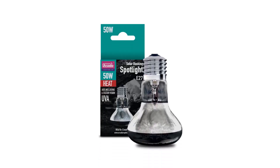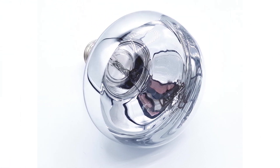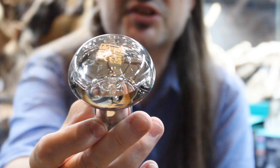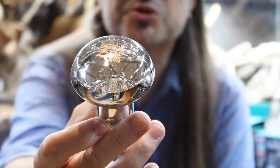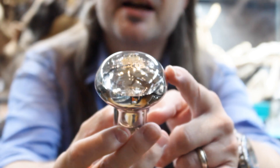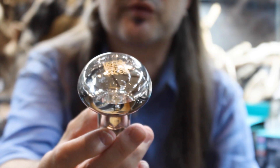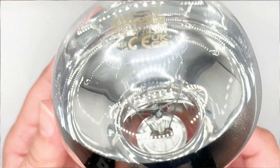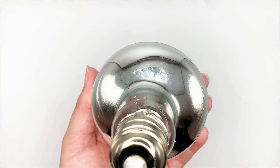This here is a 50-watt tungsten spot lamp. If you can see on the inside, there is a tungsten filament coil all wound around a cradle. As you pass energy — positive and negative — through the lamp, it basically shorts out through the coil and the coil will start to glow. The lamp envelope has one of the noble gases inside, usually argon, which stabilizes and protects that filament. This is a spot lamp, so you can see it has a clear front and an internal aluminiumised reflector inside the lamp.